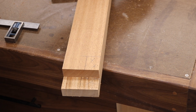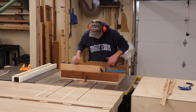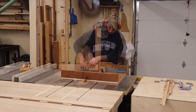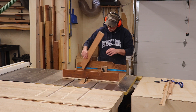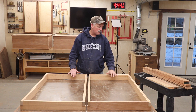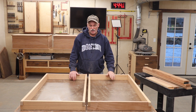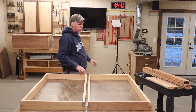It's time to cut those fingers first. I know the lines are kind of hard to see, but I'll set up stop blocks at the table saw and get all these knocked out there. I got the finger notches all cut and they turned out great — I'm happy with those. We're going to get over to the bench next and start rounding off these fingers, just like we did those fingers.